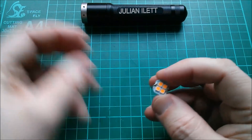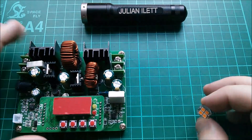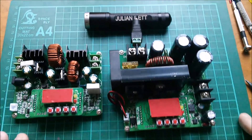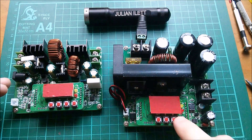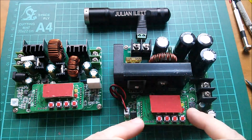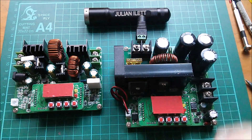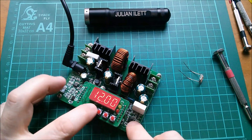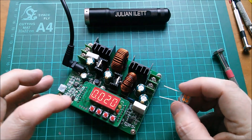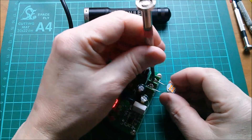Now if this does indeed need 80-something volts, then this power supply - which can only go up to about 38 volts - isn't going to drive it. But I'd like to use this one first, because the only power supply I've got that will go up to 80 volts is this one, which goes up to 120 volts - it's a bit of a beast. I'm a little bit concerned because this only goes up in increments of 10 milliamps, and I'm planning to set it initially to 20 milliamps or something. Something just doesn't seem quite right about having a power supply regulating 85 volts at 20 milliamps. But let's try this one first and take it up to maximum voltage.